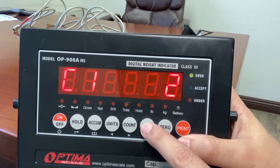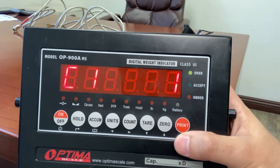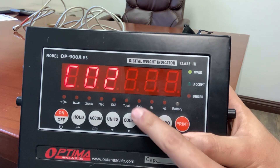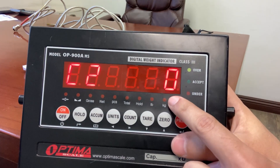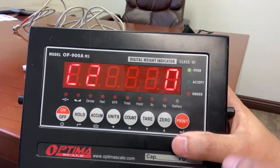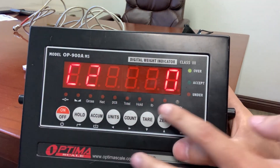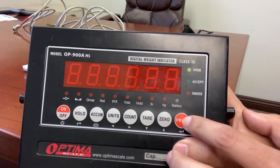If you're going to weigh in kilograms, you can press the tare button to make it one. Whatever you weigh something when you first turn it on, the default will always be kilograms. For most customers, keep it in pounds. Moving to C02 as your next setting, press the print button and you see C20. The zero means there will be zero decimal places. If you want one decimal place, press the zero button to increment or the tare button to decrement. In my case, I want zero decimal places, so I keep C2 at zero and press the print button.